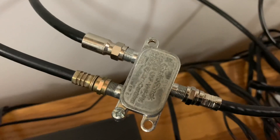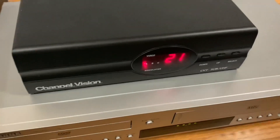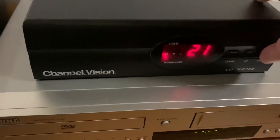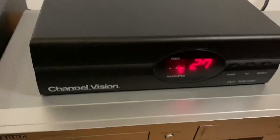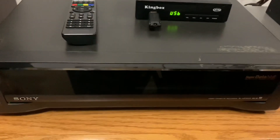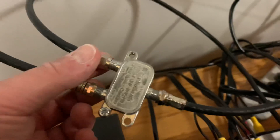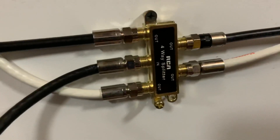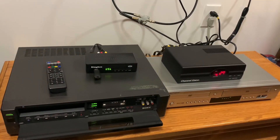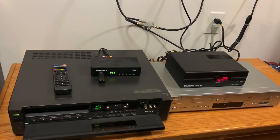Here I'm using a diplexer to combine the signals from my TV antenna as well as from a UHF modulator, which allows me to generate three in-home TV channels — currently on channels 21, 37, and 27. This is connected to a VCR, DVD player, an old Sony Betamax, and a media player, allowing me to create my own in-home cable system by combining these two signals. This then goes to a splitter which distributes those signals to TVs throughout my house. If you're interested in learning more about my home cable system, I made a video about it and will put a link in the description.